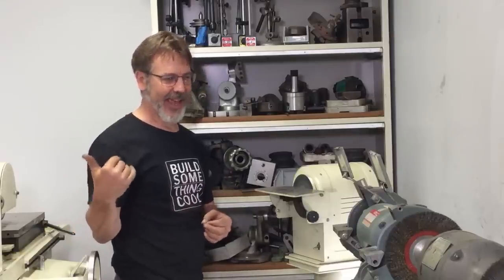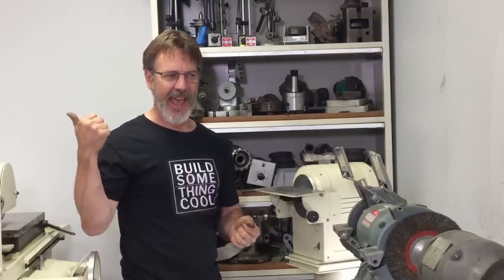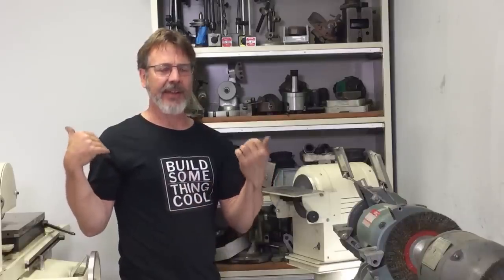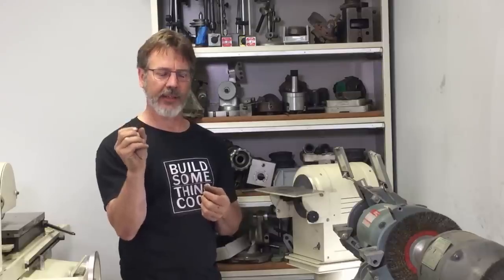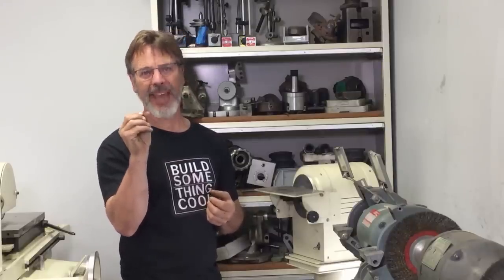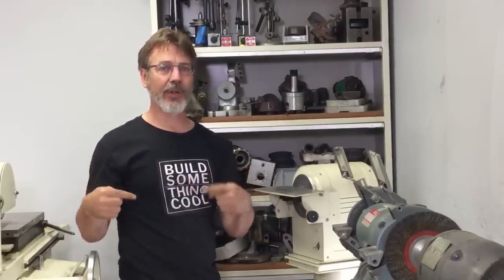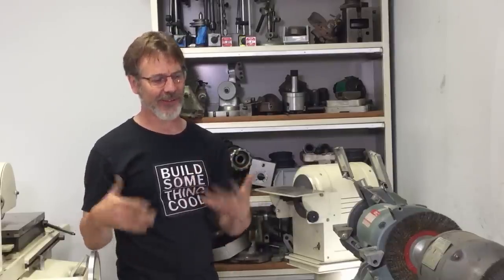I had a Hardinge metal lathe, and I was going to do a rebuild on it, but decided not to bring it here. That thing was so worn out. The Acme threads on it for threading were actually triangle shaped when they're supposed to be Acme. That's how worn out the whole bed was. But somebody was still producing accurate parts on that worn out lathe to get it that worn out. So that's kind of it.